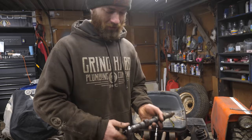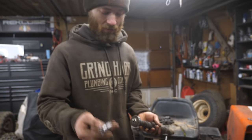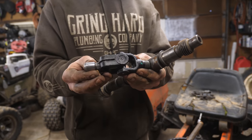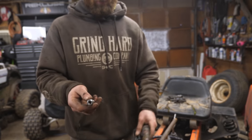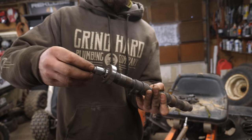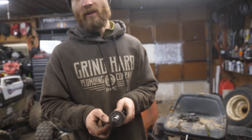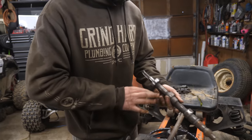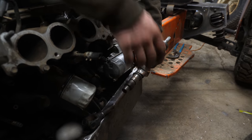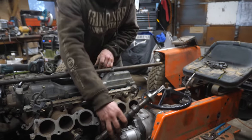I need to adapt this end or weld it to a U-joint, but I want the bearing to be removable - it's stupid to have a non-removable bearing. I took this little piece that fits in the U-joint and is length-adjustable, put it in the lathe, straightened it out, and added some threads since there were already threads in the end. I threaded in a piece of bolt and now it gets perfectly centered and snug so I can weld it without warping or being off-center. I'll make a little sleeve that goes over both pieces, weld that on nice and straight.